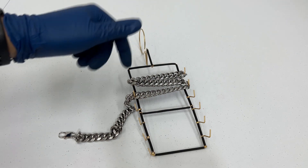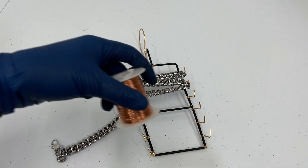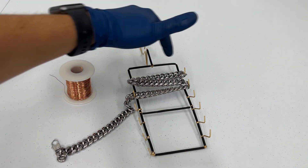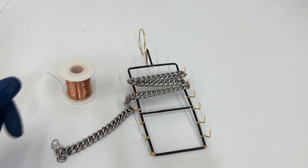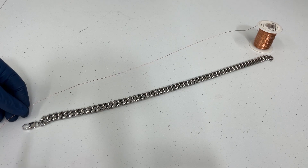The trick ensures it's not plating half of the rack while the other half doesn't get plated. What we can do is add a little bit of copper wire — just a very thin copper wire — in between each of the links, then put it on our rack. That ensures all the links are touching and it will have a good connection for the gold to go on properly.